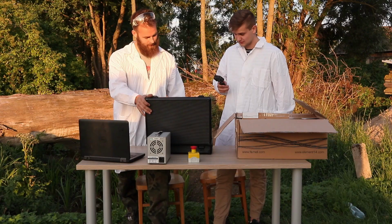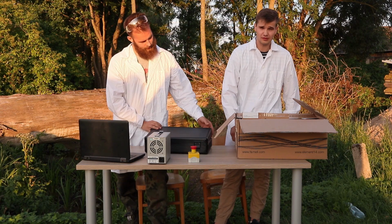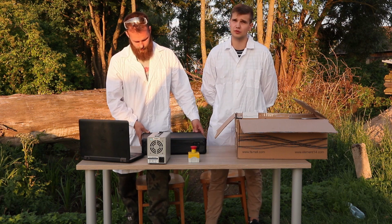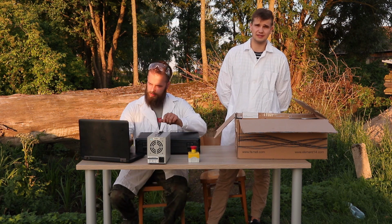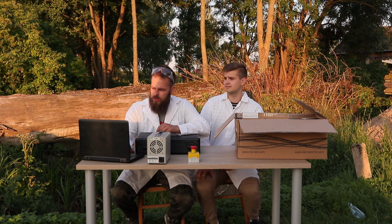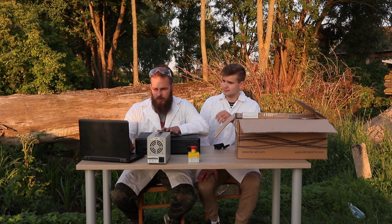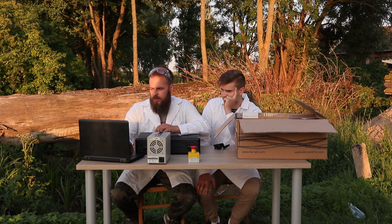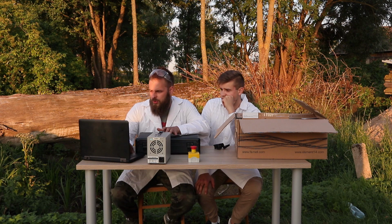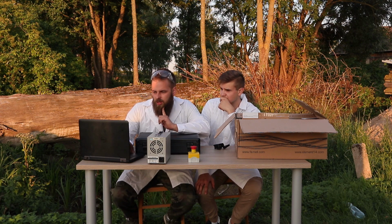Yeah. So, let's get back to our motor. To be able to control our motor, we also need a controller. Trinamic, the producer of our motor and the controller, also gives us free access to the controller programming software. We can download it from the trinamic.com website. The Trinamic Motion Control Language Integrated Development Environment is used mainly for developing standalone TMCL applications. However, the TMCL-IDE also includes a function for using commands in direct mode. Furthermore, it's possible to log data and save it in CSV files.